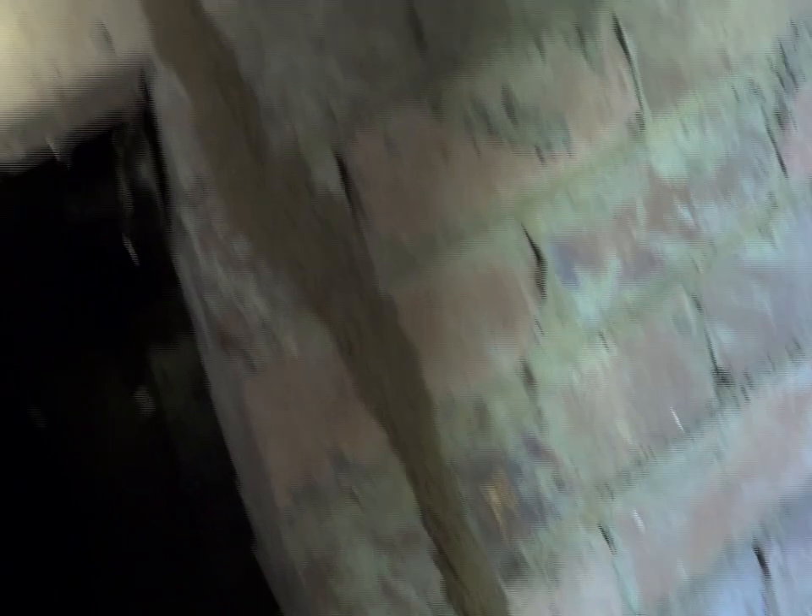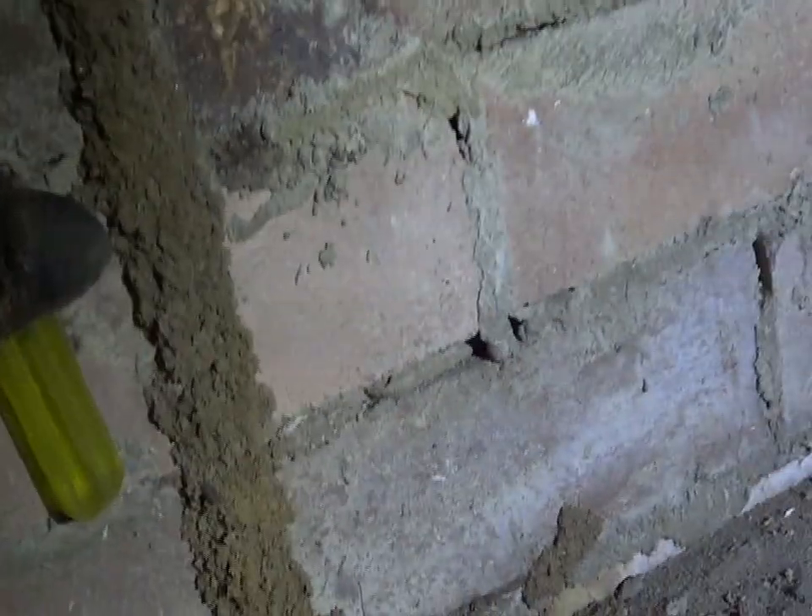You need to make sure you check not only all the timber, but all the brick walls too. Look at this — this is termite mud workings going from the dirt all the way up to the timber. The size is not small — this is a very big mud tunnel.